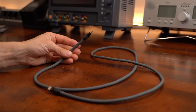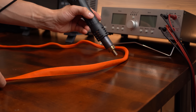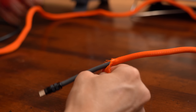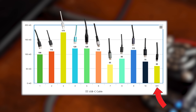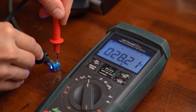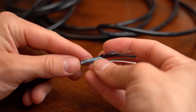Eventually I was happy with my solder joints and tested the cable again to make sure everything still worked — which it did. I put on a layer of nail polish for protection and closed both connectors up with some nice-looking shells, which you can also get for pretty cheap. There you have it: a DIY USB-C cable. I tried to enhance the raw look with a heat-shrinkable cable sleeve, but I was too stupid to get it on right and removed it afterwards. Measuring the cable resistance revealed it was the lowest of all my cables.